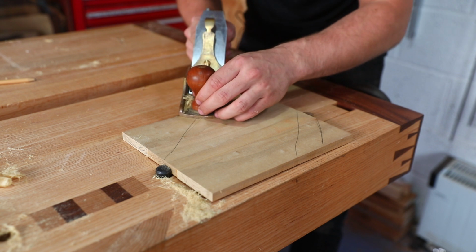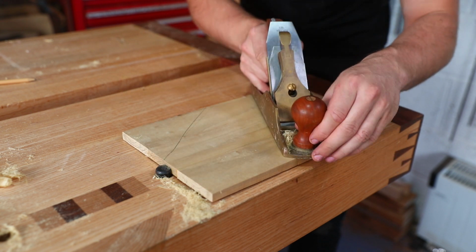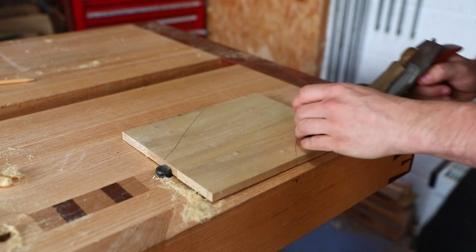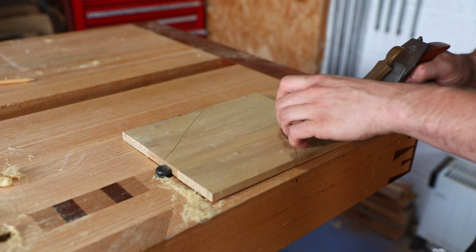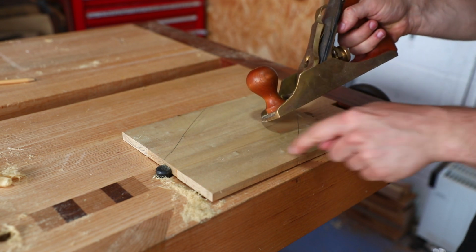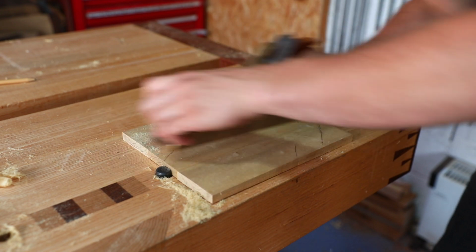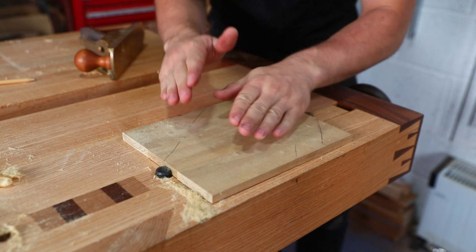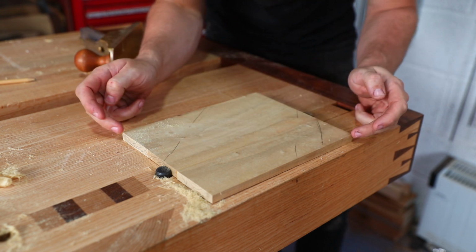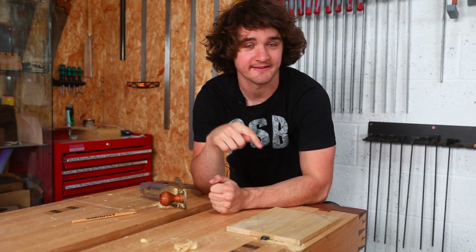I really need to spread this plane out and get it working corner to corner this way and all the way out here. Perhaps even go across this diagonal, but be careful not to hit that corner and that corner. Instead, maybe drop it on sort of here and lift it off there, like that. And just work on getting that sort of flat plateau off and then bring it down level with these two corners here. Now I will just stress, that is how I'm reading this lid in particular.